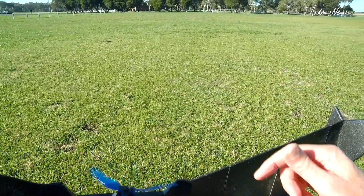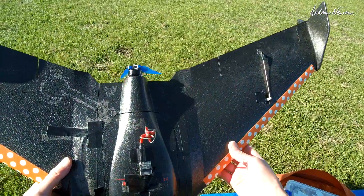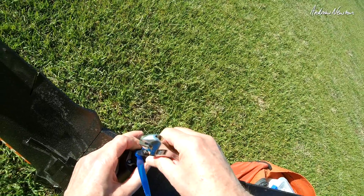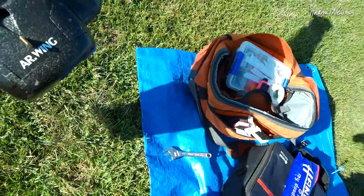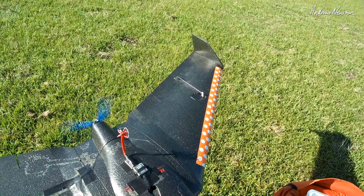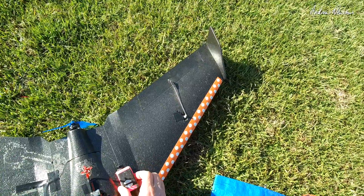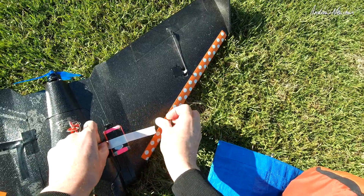It's better. I've just rotated it around on the shaft a bit and that's got rid of quite a lot of the buzz, but there's still some there so I need to keep trying to reduce it. I may even need to put a bit of tape on one of the blades. Oh, that's much better. Just needs a dynamic balancing.